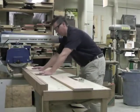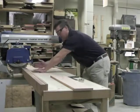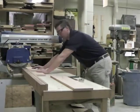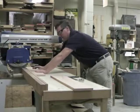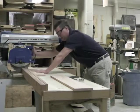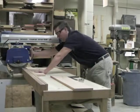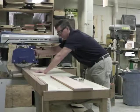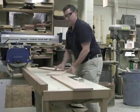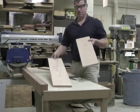Since I have enough material to still maintain a six-inch margin of safety, I can make the next cut. If I couldn't, I'd flip the board around so I had more distance on the left-hand side to maintain my margin of safety. I line the blade up with my mark, return it to the rear, hold it with my left hand, turn the saw on, pull it through, return it, and shut it off. Now I have my two pieces of convenient length.